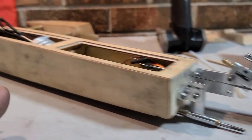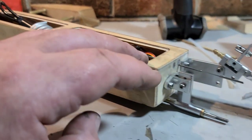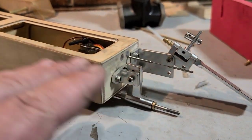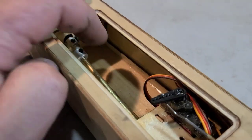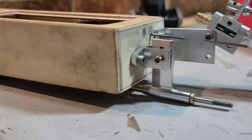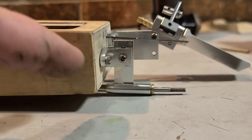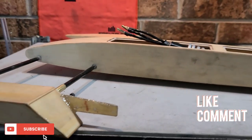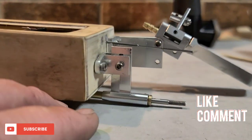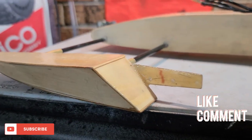All right, so we still got quite a bit of stuff to do, but the video is already long. I actually walked you through the whole process, start to finish, stuffing tube and cable installation. This will basically work for any boat with a submerged drive. Riggers actually call for a submerged drive setup. I've run surface drives on riggers and it doesn't work. Not saying it wouldn't work, but I don't think it works as good as a submerged drive. Submerged drives get the back of the boat up, lowering the AOA for a smoother ride.